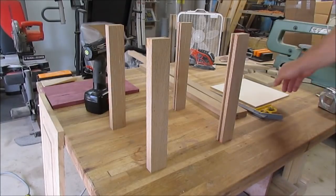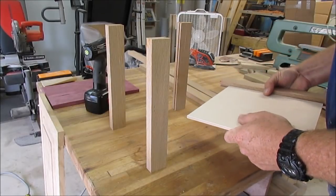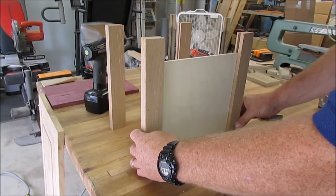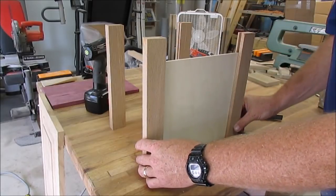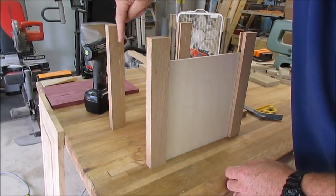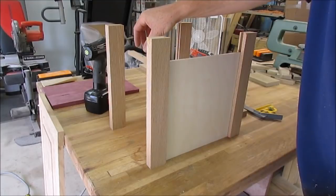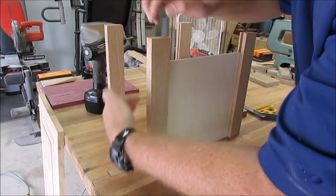To give you an idea of what I'm trying to do — fit these two in here so you'll have one side, and they'll actually sit inside the middle up some. I'm going to have to cut the inside of this as well to make the dados for the second sleeve here. The front and the back is cut. Now I need to cut the two sides.